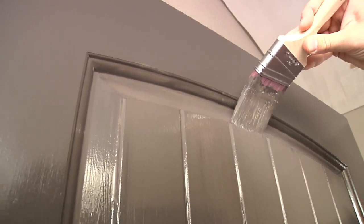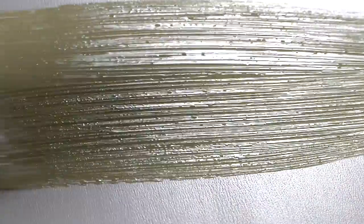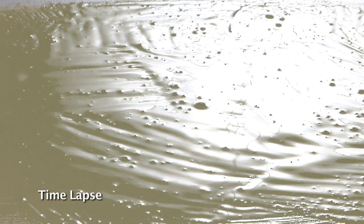As an oil, Advance is durable, and it flows and levels really well. This makes for a very smooth, glassy finish you usually only get with a conventional oil-based paint. Since it flows and levels so well, Advance can be forgiving to work with. Minor brush marks tend to flow away as the paint film levels.